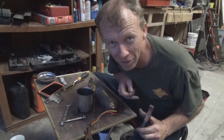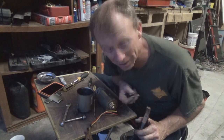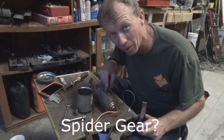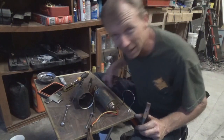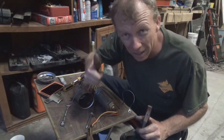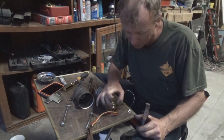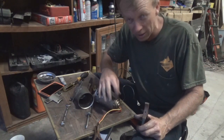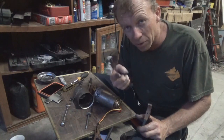And it's turning — oh my gosh, it worked! I just saved more money than Geico can save me! It's actually turning. What it was — that little worm gear in there was rusted up from not turning in so long. Now all I've got to do is put my seal back on, put the long bolt back through the reservoir, get a line kit, and the hydraulics should be good. If not, I'll buy hydraulics and a line kit, but the motor is good. That's how you rebuild one of these motors — hardest part is getting those little magnets and bushings back on and reaching in between the housing and the end cap with a screwdriver to pull them apart.